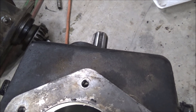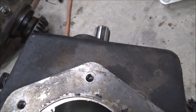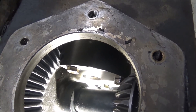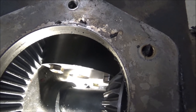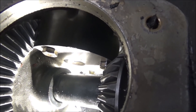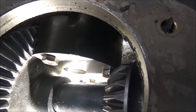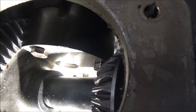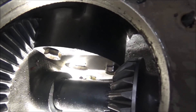You can hear that tick — it's just a very little bit of backlash, running out like it should be. Once this thing's got oil running through it, it has to have clearance for the oil to keep everything cool. I'm a little concerned about whether or not there'll be enough oil flow through there to keep that bottom shaft cool, but it runs submerged — it's always under oil all the time — so I don't think it'll be that big of a deal.